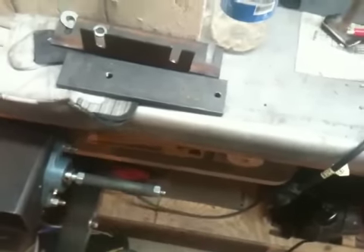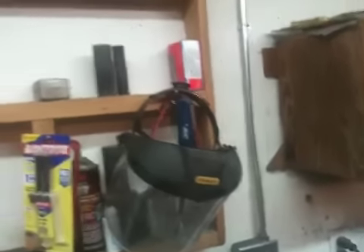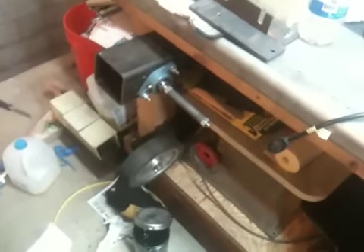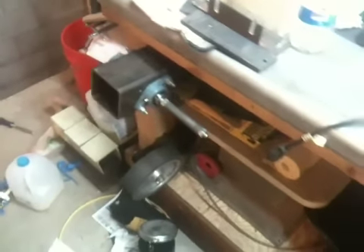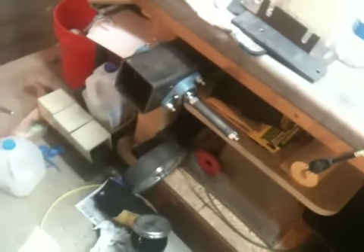This is easily removable for a slack belt attachment, which works very well as well. I do have some other attachments, including a small wheel attachment using some oscillating sander spindles — this one is a three-quarter spindle. I also have the eight-inch contact wheel. I have more spindles on my shelf: a one-inch, two-inch, three-inch, and maybe an inch and a half. I mostly just use the smallest, which is the three-quarter — it's perfect for finger choils and similar work.